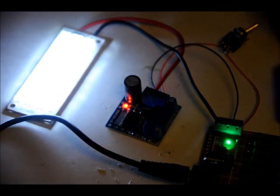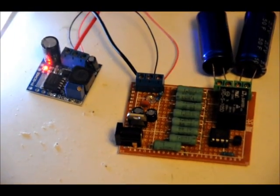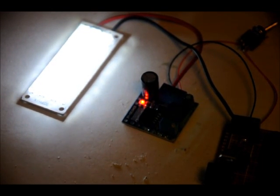I'll turn on my switch. That's at 12 volts. I can actually unplug this now — we're just taking power directly from the capacitors. At 8 volts it's a little bit dimmer, but still very useful. If I were going to use the 12-volt function to keep it as bright as humanly possible, I would be using 400-farad capacitors, which would keep that LED at 12 volts and full luminescence for well over half an hour per charge.